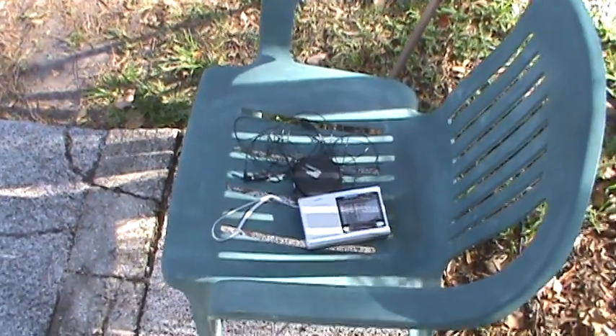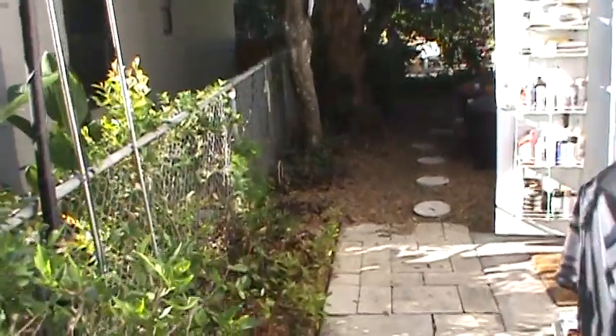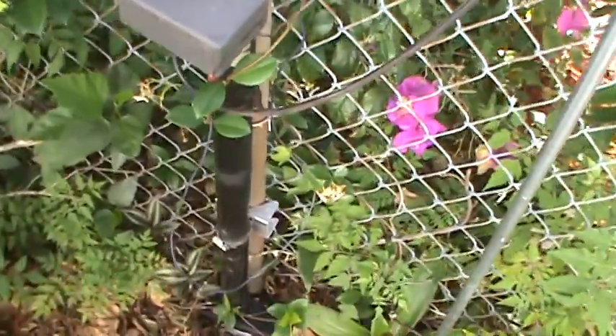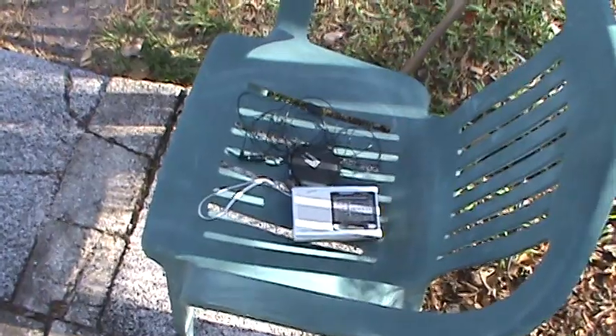And height up in the air is best. Let me just show you real briefly — over here is that black pole, which is a 31-foot telescopic fiberglass pole that MFJ sent me. All it is is a piece of wire wrapped around this pole going 31 feet in the air. It does come with a matching transformer to match the impedance. The impedance of just a long piece of wire is going to be pretty high for what your radio wants — your radio typically wants 50 ohms — so having a matching transformer will definitely help.